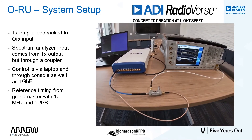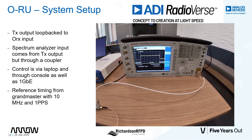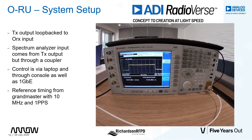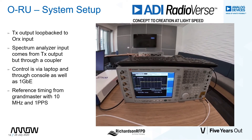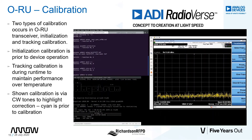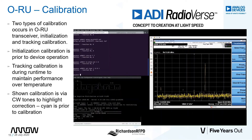For simplicity, our setup has transmit one's output connected to an RF coupler and then fed back into the observation path, while the coupled port is connected to the spectrum analyzer with 20 dB of loss. A positive 12 MHz CW tone from the LO will be set up on the transmit path. On the spectrum analyzer, you can see the tone pop up.